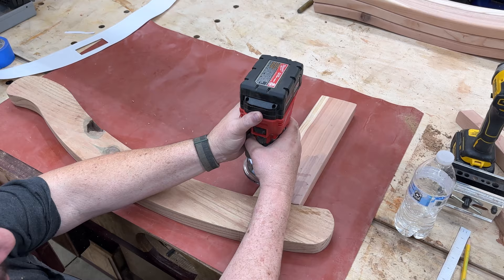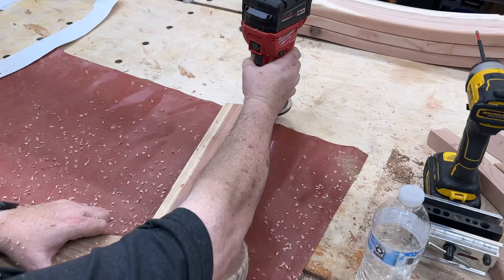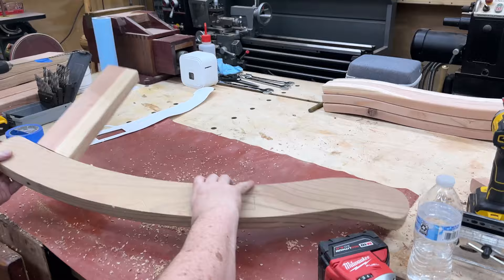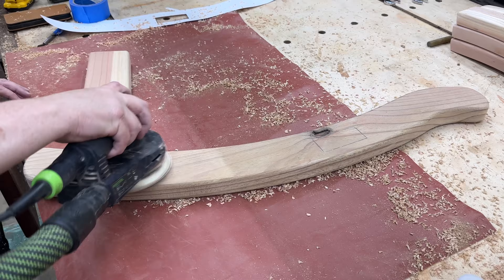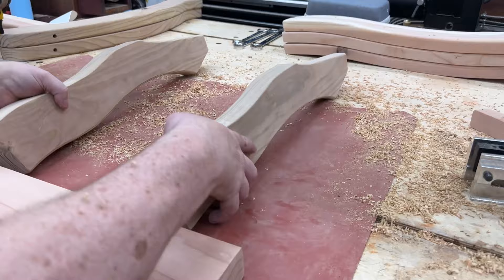I like to hold off on routing the leg and the rocker to a point where I can do them together — I think it looks like a more continuous routing when that's all done. If you enjoy our videos, I hope you'll consider subscribing and giving us a thumbs up. New subscribers are the single most important way to help this channel grow. Rather than waiting till the end to sand everything, I kind of just sand as I go. Being outdoor furniture, I typically stop sanding between 120 and 150 grit and don't bother going further, because it's going to get an oil finish.